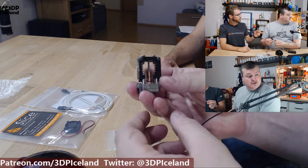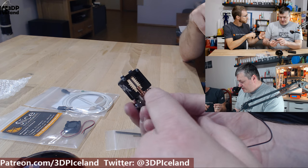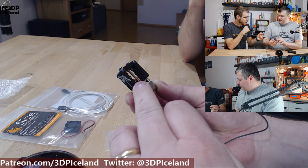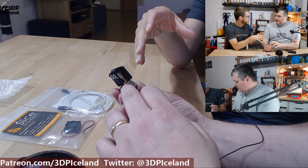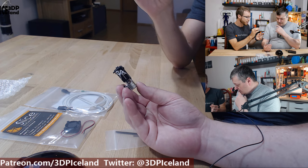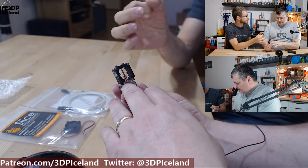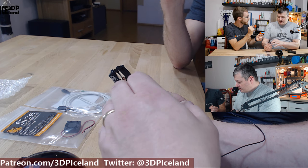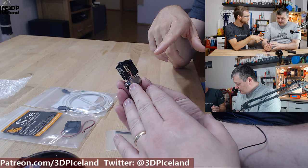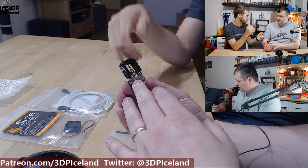You can look down the barrel there and you see it is a very, very thin tube. We've got a thin tube in the middle for the filament path and thin tubes acting as standoffs between the hot section and the cold section. That keeps the heat isolated where you want it, melting your filament and not moving up into the cold section. Because this part is hot and this is super cold — the filament goes in the middle — are those standoffs a problem in regard of heat transfer up to the heat sink? We're trying to keep as much heat in the hot block as we can. We don't get a lot of heat creep up into the heat sink. We made the tubes as thin-walled as we possibly could to reduce heat creep upwards. They're tubes, not solid — extremely small cross section. We've got about 15% the cross-sectional area of what you'd have in a normal threaded heat break — so 85% less heat transfer up into your heat sink.